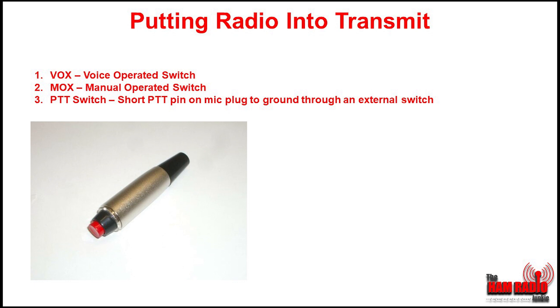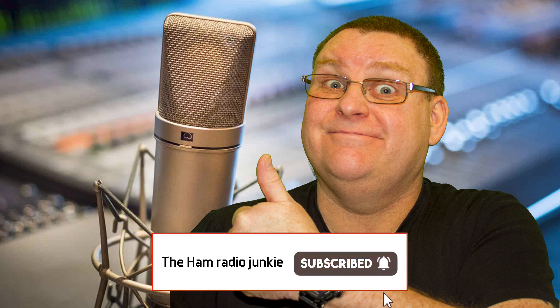Finally, the one I normally go for is a momentary PTT, or push-to-talk switch. This is operated by a simple plunger which shorts out the ground and the positive on the PTT, and every time you push the switch it makes contact, putting the radio into transmit. And ladies and gentlemen, that's how you wire up a professional mic to your ham radio setup, either directly or through a mixer. I hope that's given you the knowledge you were looking for. If it has, consider subscribing to my channel, hit the bell, and if I've not sent you to sleep, how about a thumbs up? My name's Keith, my callsign is G0FEA, and I'm the Ham Radio Junkie — I'll catch you next time.